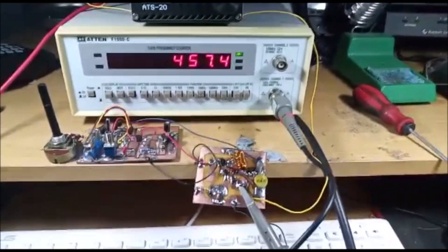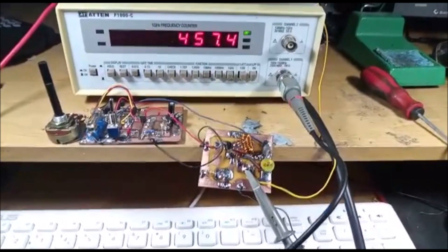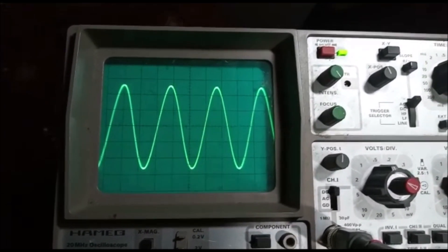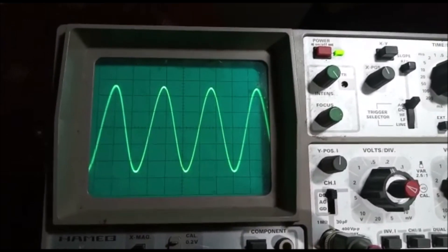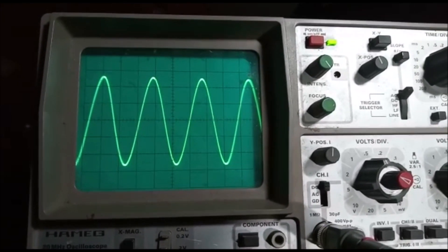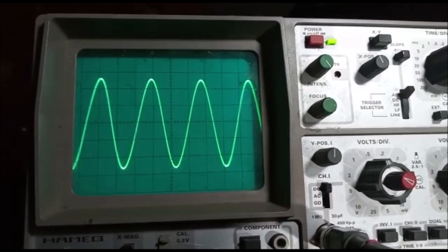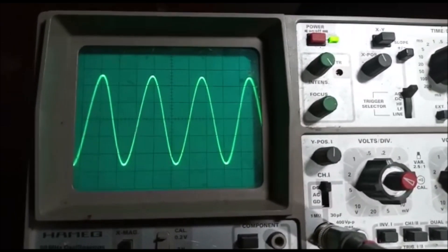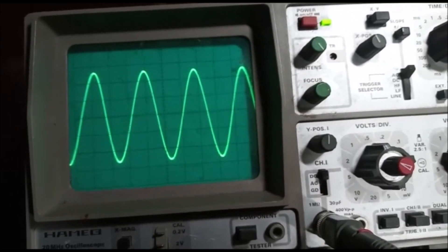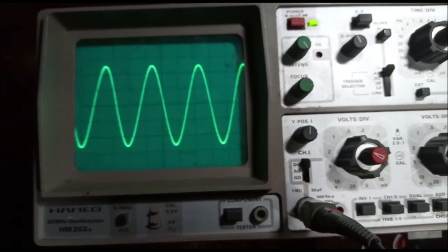In the next section I'm going to show you the output of the BFO on the oscilloscope. There's a nice clean signal at the output of the BFO — a nice sine wave. I calibrated the screen and it's about 3 volts peak-to-peak. I'm going to vary the BFO now by tuning a couple of kilohertz, and you can see the way the sine wave there changes as well.